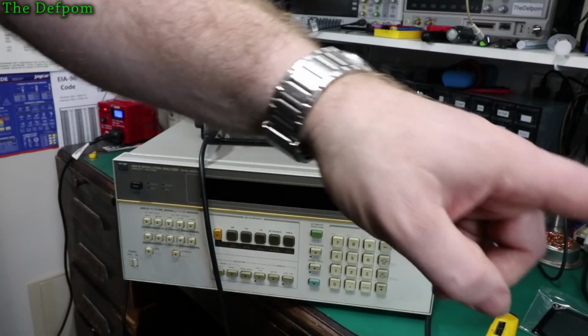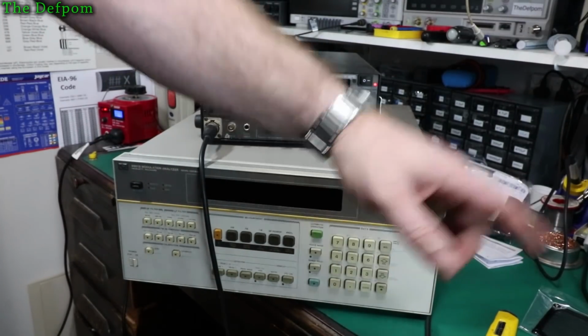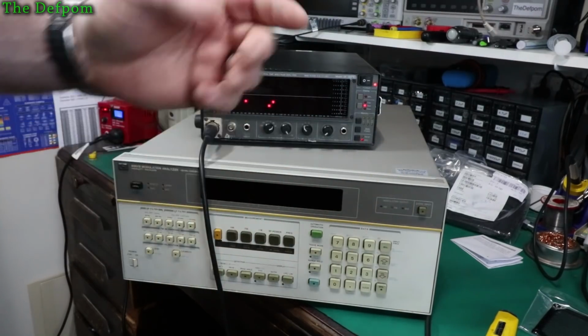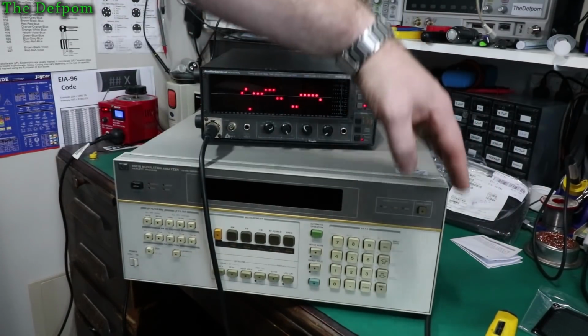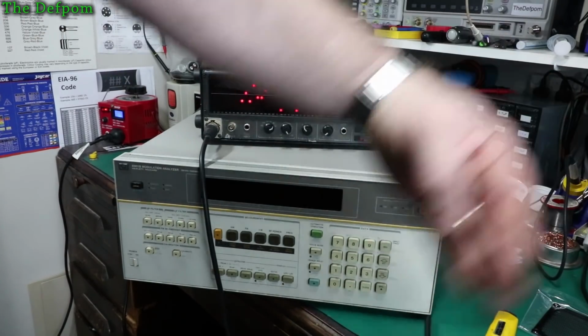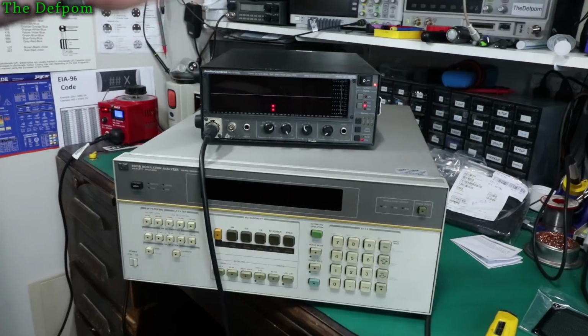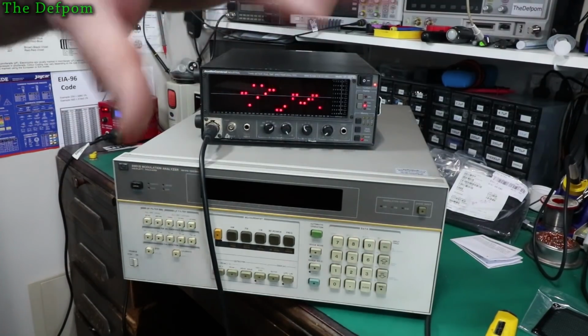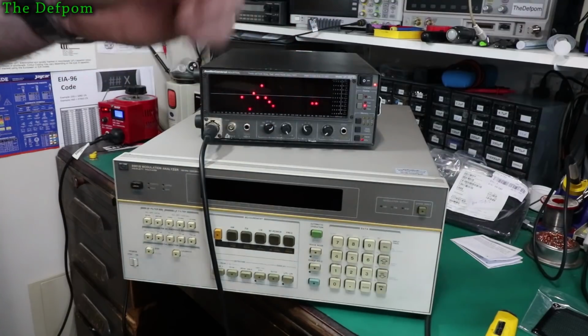And the measurement wise, it is 34 centimeters to this front corner, and about 90 to the fan on the back. Essentially in line with the side here, so it's just off the camera view. It's almost in line with the side, just slightly off angle there. So when I do the fan replacement, I'm going to try and do exactly the same positioning and everything as well, so it's directly comparable.